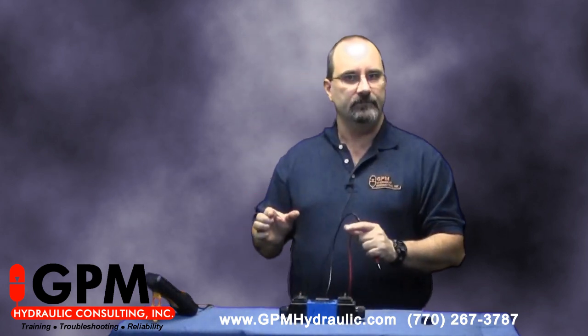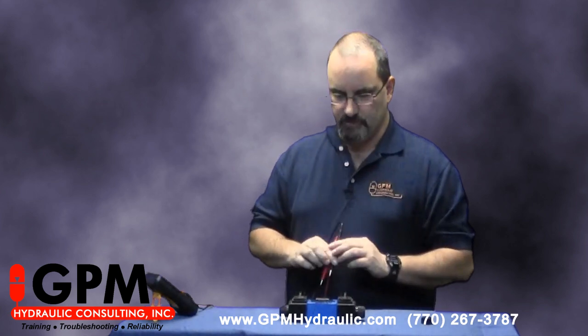Normally we're going to find one of these coils is going to be somewhere between zero and 50 ohms, but not zero. If it's zero, that means the coil is shorted.